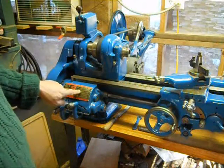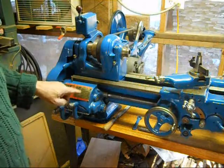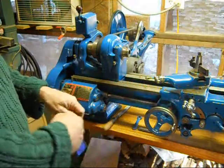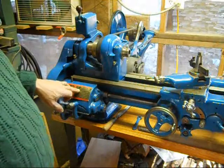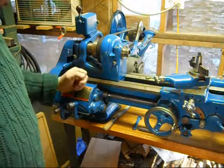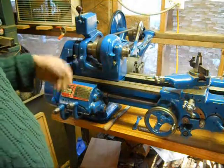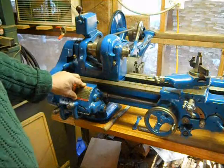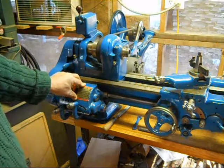The first time I did it, I don't think I checked that, and I don't think I had it lined up good enough, and as I was tapping it with the hammer, I was off just a little bit on that 18 tooth, and I broke it and didn't realize it until I had the gearbox back here on the machine, and it was making that thumping sound. So that was something I learned the second time around when I was putting it together.